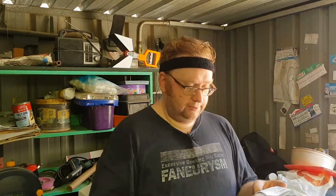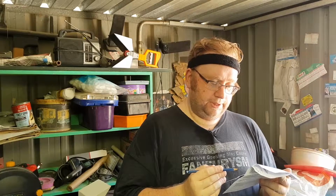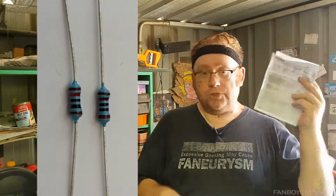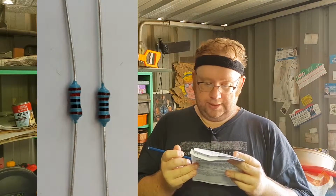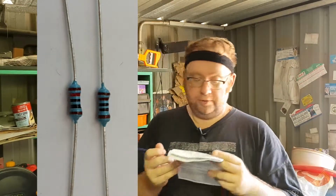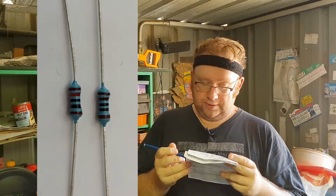See, you've got ones here like brown, black, black, brown, brown. And then you also have one here, which is brown, black, black, red, brown. I've taken a couple of photos of these. They should be on screen here, which is all well and good. But they have two different values. One of them is 10,000 and the other one is 1,000.